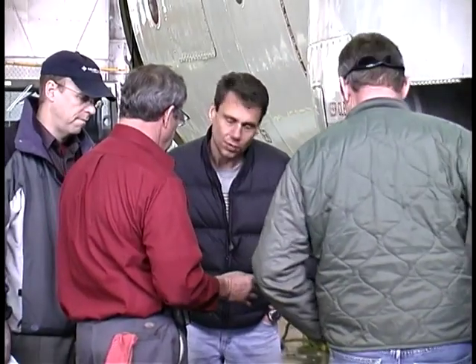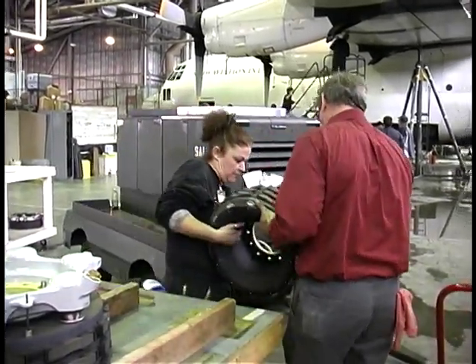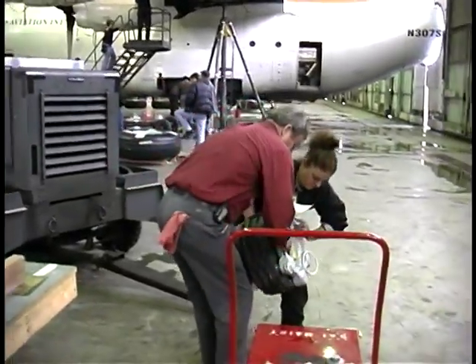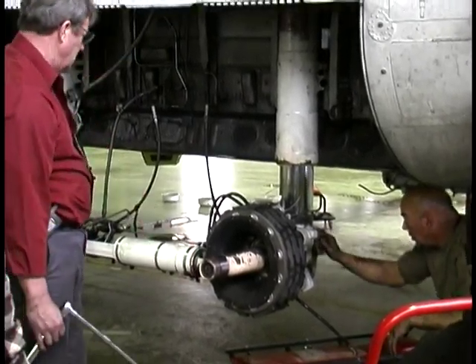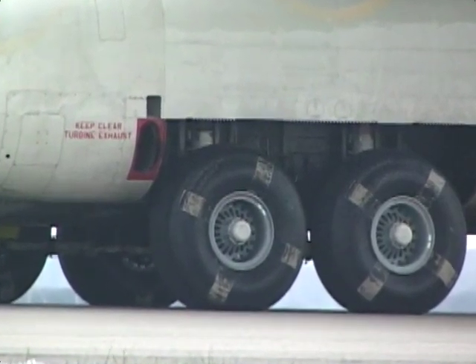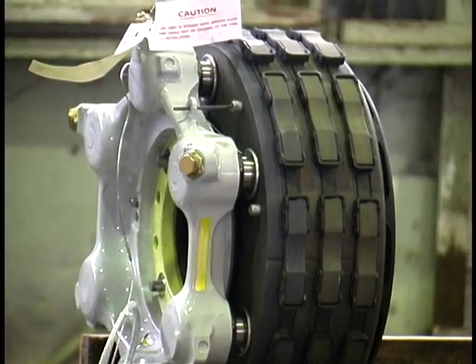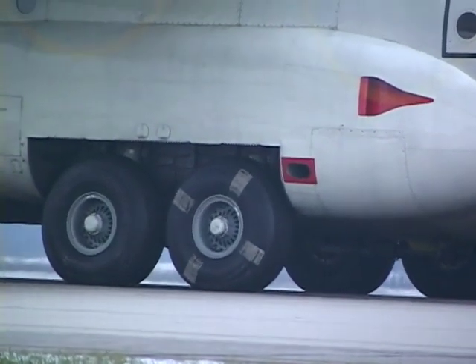Once the baseline testing was completed, Snow Aviation's C-130 aircraft was reconfigured with the Messier-Bugatti carbon-carbon brakes. This upgrade included the carbon-carbon brake assemblies and slotted main landing gear wheels. The carbon-carbon brake assemblies provide greater friction and heat tolerance while weighing less and lasting an estimated seven times longer than the steel brakes currently in use. Slots in the wheels made specifically for the Messier-Bugatti carbon-carbon brakes provide faster cooling rates for the brakes while maintaining all the necessary strength of the solid original wheel configuration.